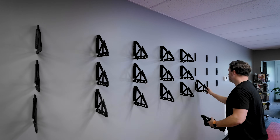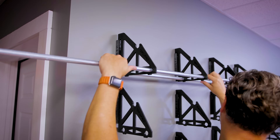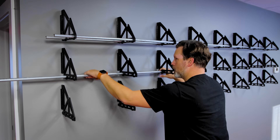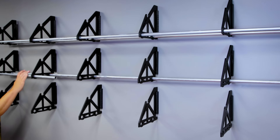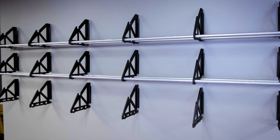Now that we've finished installing all the 3D printed cleats, we can start putting the 3D printed brackets into each of those cleats. When it comes to installing the conduit pipes, I just slid them through the openings and held down the brackets as best I could while sliding them through the first initial rows. Since they're 10 feet long, it got drastically easier the further I went along — I used a twisting motion to help ease some of the tension when running the rod through the hole.